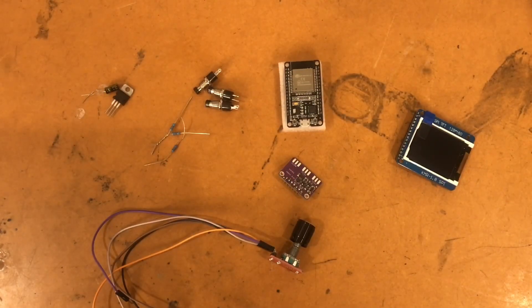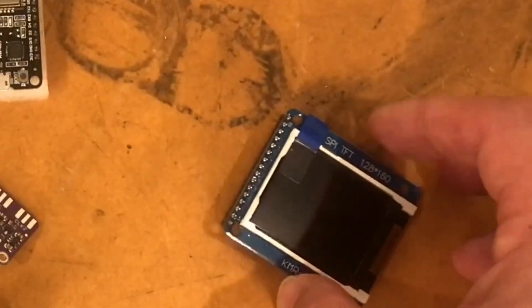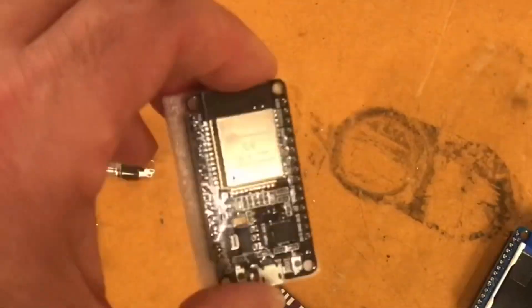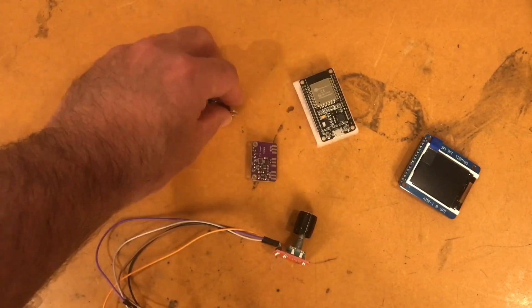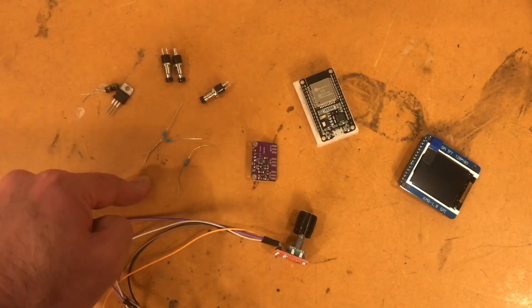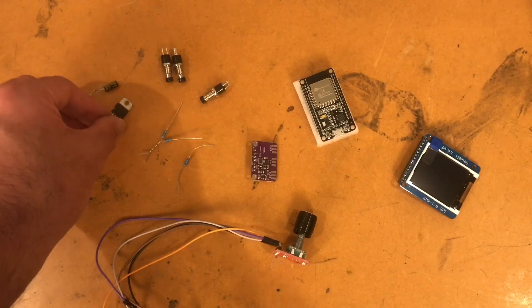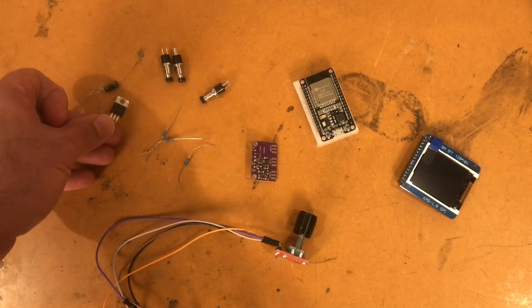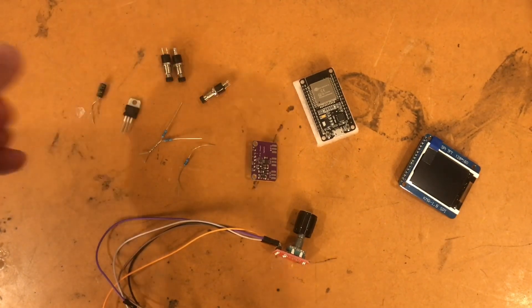Here are all the parts that go into that miraculous retro-style analog/digital DDS VFO: a TFT 1.8-inch 128 by 160 screen, an ESP32 development board, an SI5351A clock chip, a rotary encoder, a few momentary action switches, 2.2 kilohm resistors — I had to series a couple up because I couldn't find a 2.2k — a linear 5-volt DC regulator (7805), and a 10 microfarad capacitor for filtering on the supply.